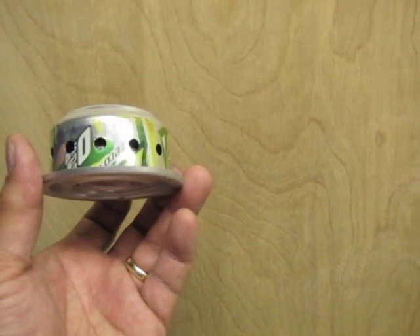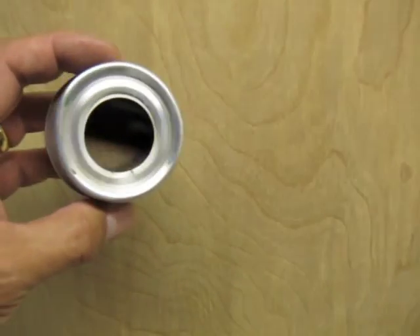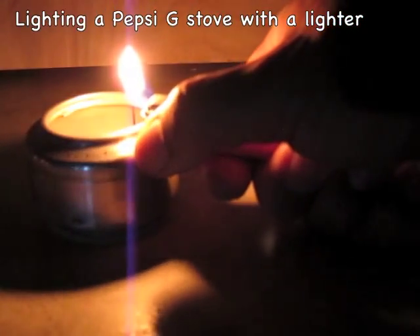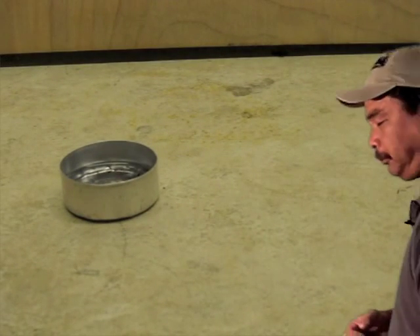Here's an example of two different stoves that have restricted openings on the top. Because of that, you would expect the gases to come out at higher velocity than lighting a Pepsi stove. Now another example is your basic tea light stove. This is a very nice stove because if you look at it, there's really not much entrapped air volume within that stove, and so therefore you're not going to get the same kind of reaction as you can with something that has a well in it.